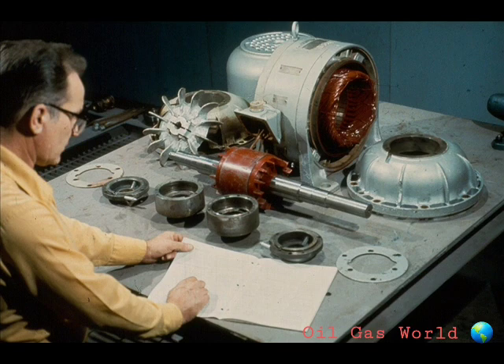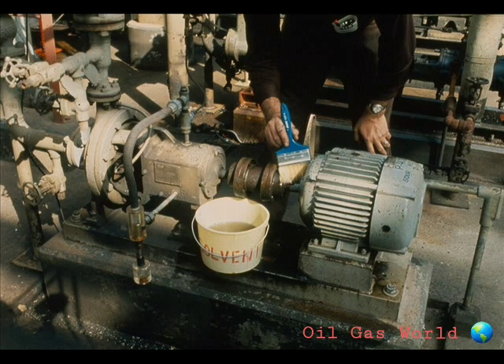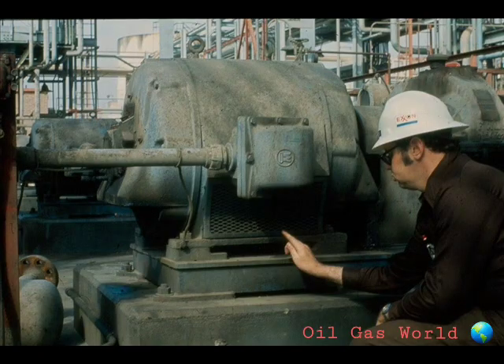One of the most important causes of damage or excessive wear in electric motors is poor maintenance. These motors must be properly maintained at all times if you expect the most from them. Dust, as shown on this motor, is probably the primary cause of most damage. Dust is fine, pulverized sand. It insulates the motor, raising the heat level. It plugs ventilation spaces and acts like sandpaper on bearings and other parts. Dust also unites with water or oil to form a gummy substance like this dirty, rust-colored film.